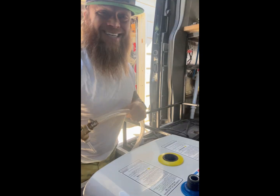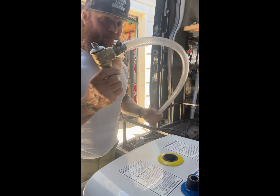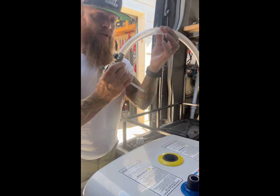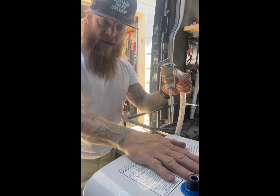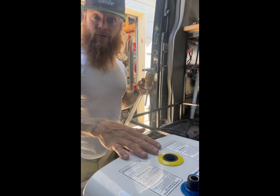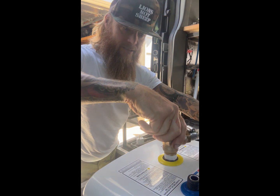Step one: prepare your pressure release valve. The unit ships with a pressure release valve. I attached it with a barb fitting and one-inch hose and some plumber's tape. If the unit gets too hot and pressure builds up too fast, this valve will release and the water will shoot out the bottom of my van rather than explode the unit — which is quite a good thing.